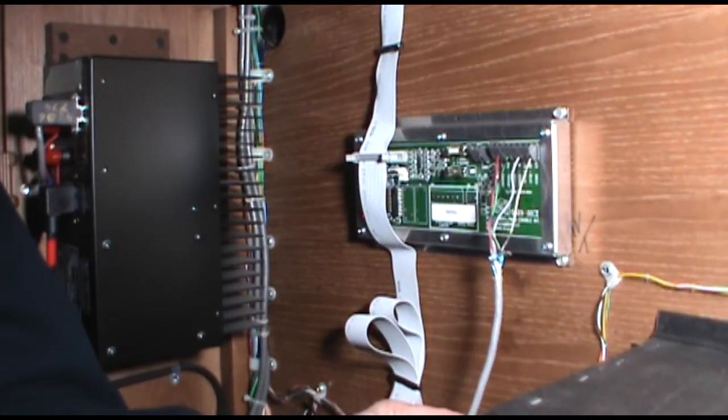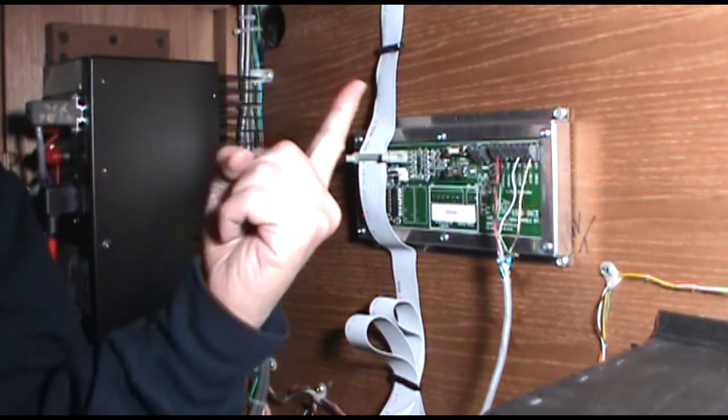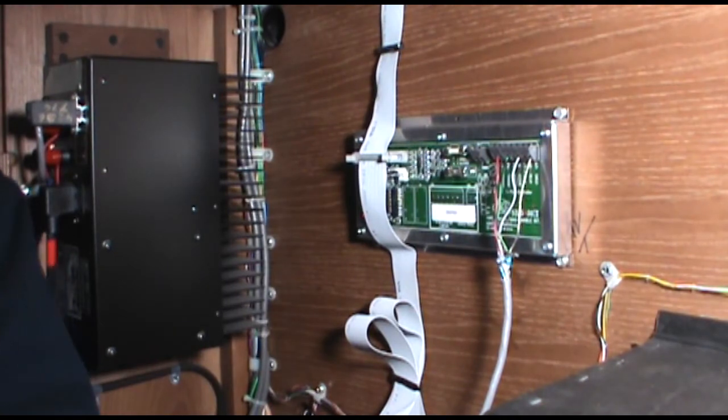That's all you have to do — seven wires going into the console, from the console over to the pipe chamber. Our decoders are all hooked up, connected to the existing relay. They can also be connected directly to the pipe valves. Then all we have to do is tell the PIM how to translate the data the console is sending over to the data we want it to receive on the other end.